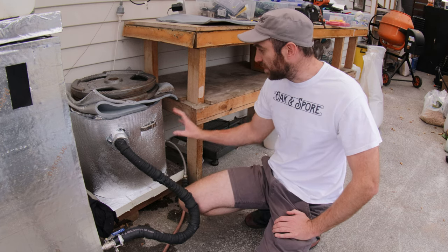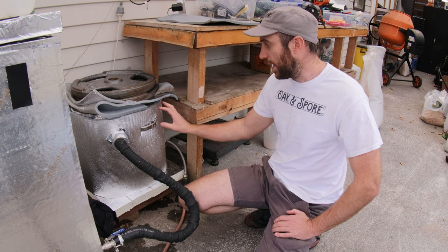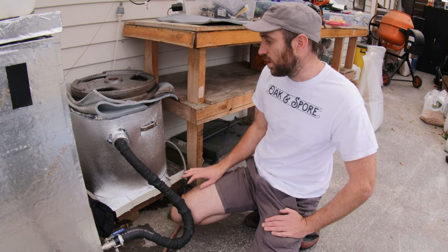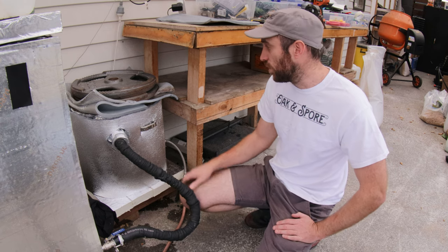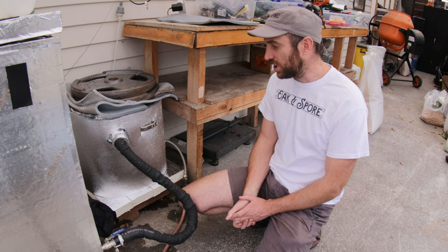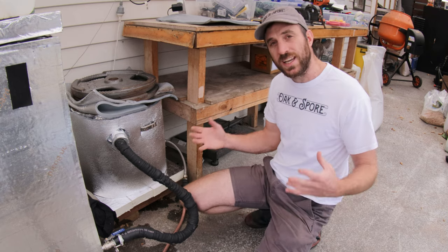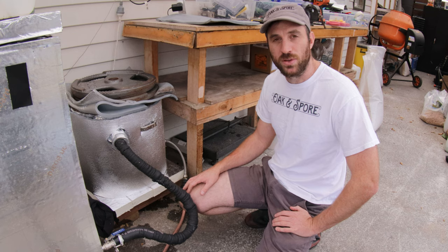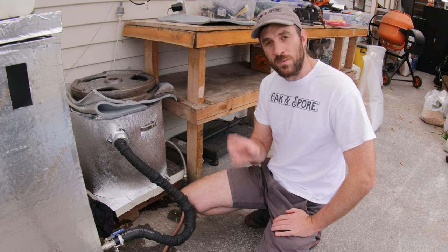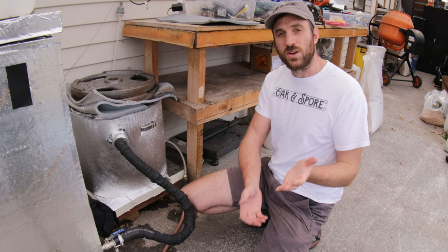Since I took a measurement from this yesterday and again today, it has actually increased its efficiency by a significant margin. So it is really worth insulating your boilers if you're using one — the more the merrier. Boilers are measured in kilograms per hour of output. So a six kilowatt boiler might have around eight kilograms of water output per hour — turning to steam and pumping out. We know the energy output of steam, so if you know the water output you'll know the energy output.